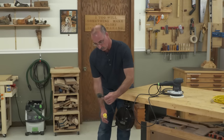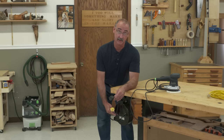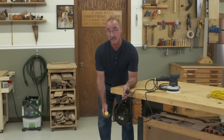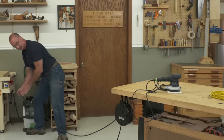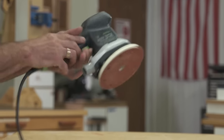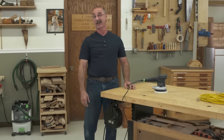Here's what happened while you were away. This side normally is the side that gets plugged into an outlet, and then this is the side you're pulling toward you so that you can plug stuff into it if this were hanging from a ceiling. So we've got a reverse polarity here. We have to change the end that's near the bench into a female plug, and the end that you're going to pull out into a male so we can plug that into the wall, just like this. Get enough cord, get over here, and when we're done we do this in reverse — neatness counts.